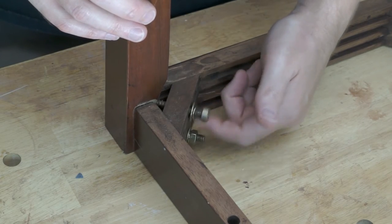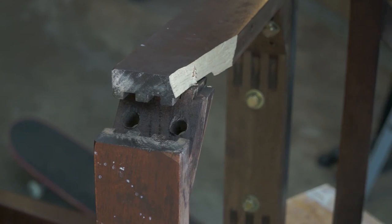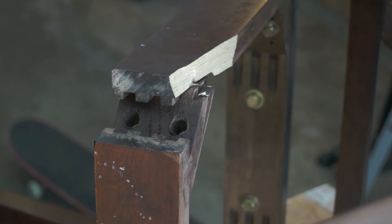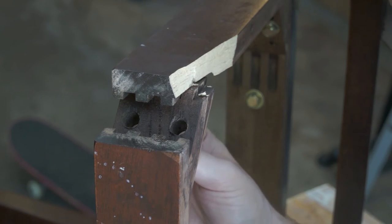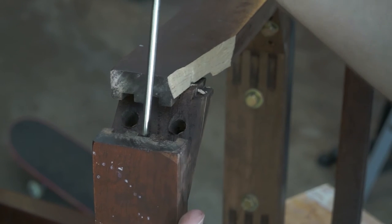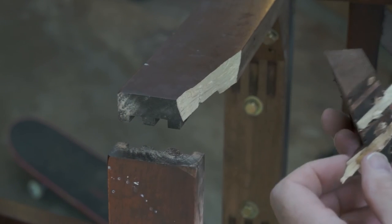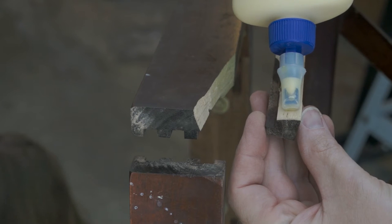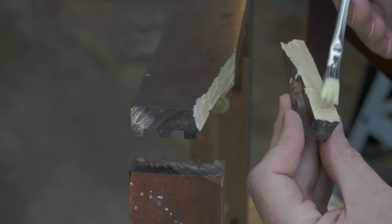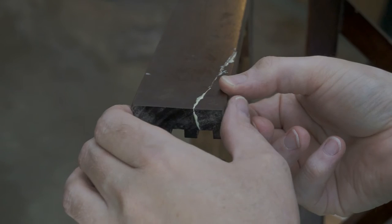I removed the leg, and the split wood almost immediately just popped apart. The angle bracket is made with finger joints, but it was held in by four screws and a tiny amount of glue. I used a screwdriver to pry the finger joints apart and they came apart with only a tiny amount of effort, though a little more wood split apart when I did this. I re-glued the broken rail, putting a good even layer of glue on both pieces and clamping it to dry. It's a really clean break along the grain of the wood, so I'm confident the repair will hold.